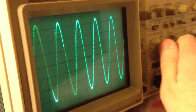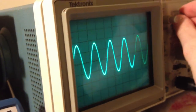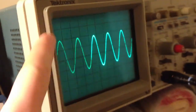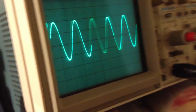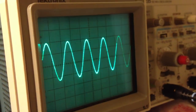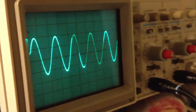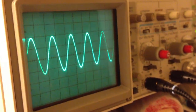Same thing again — 100Hz sine wave, full volume on that slide bar — but now I have the probe at the right RCA jack on revision 1A. Let's take a look at the scope. And oh my god, that's just going straight off the scale. Setting to 1V per division, that's around 3.5V peak-to-peak — quite a big difference compared to the other motherboard where we had 600mV peak-to-peak.